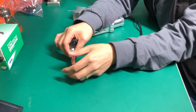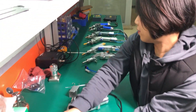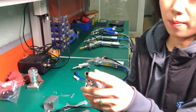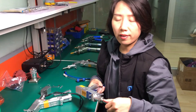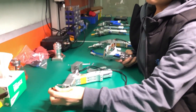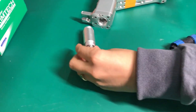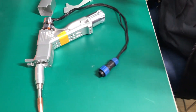And then the last part is the nozzle. We have different nozzles. Like this one is the wire-feeding nozzle — the wire goes in from here. And if you want to weld without wire, you go with this nozzle. We also have internal gas, outside gas, cutting nozzle, and flat welding nozzle — mainly five types.